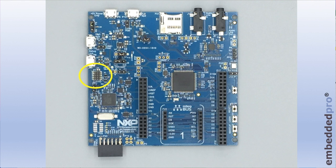Here's a USB micro connection — that's the debugger interface for the board. There's another micro USB socket labelled high speed, giving you access to the USB peripheral on the microcontroller. Here's another micro USB connector labelled full speed, giving you access to the full-speed USB peripheral on chip. There's a micro SD card socket and two 3.5mm stereo jack plugs — the one on the left labelled line in, and the one on the right labelled audio line out.